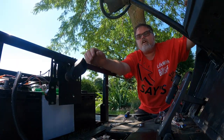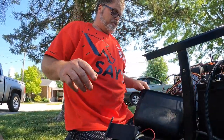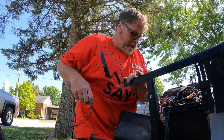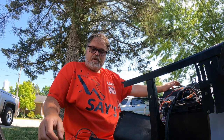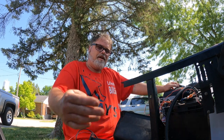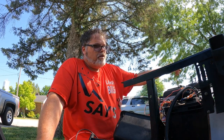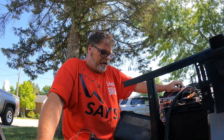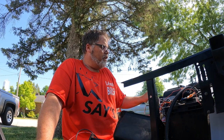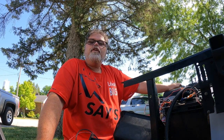We'll do our next project — charge the batteries up, make sure they're 100%. Make sure you put it in tow mode before you push these things, because that's how you take out the controllers. I'm going to check for 36 volts — negative to positive — 34 volts. So we haven't got enough power, but it's working and it's running. Let's charge it up and go from there. I put the meter on that new part — turns out it was bad, we were right all along. We slapped the new part in and got movement. On the next video we'll fully charge the batteries and try her again. I've got three deep cycles in the garage I might switch out. Join me next time on the EZ-GO project. Thanks for watching — don't forget to subscribe, like, and hit that notification bell. Love you all!